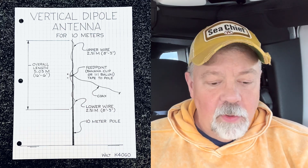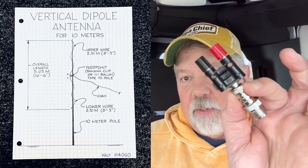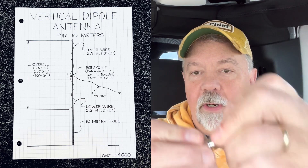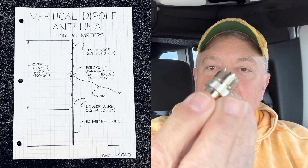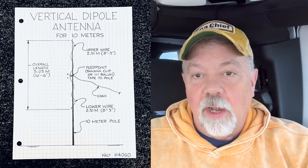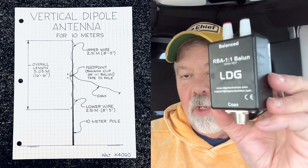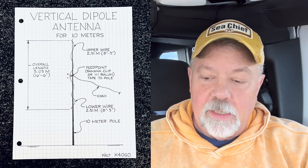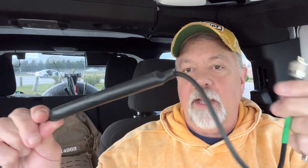It's a nice balanced antenna. Two ways to build this antenna: you can build it with a banana clip — one of these — with a little SO-239 adapter on the banana clip. Or you can build it with probably better performance using a one-to-one balun for a nice balun dipole antenna. I'm going to use this because the coax I have from Chameleon has a choke on it, so I'll have less reaction from the coax building it that way.